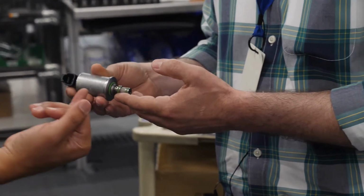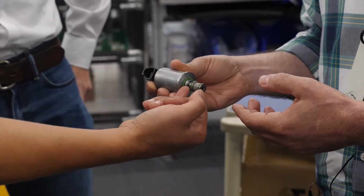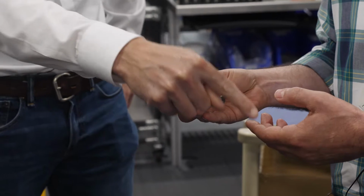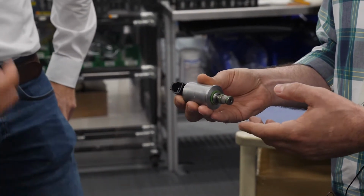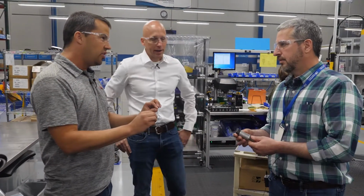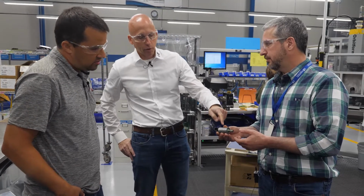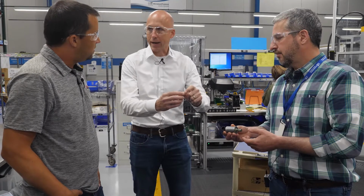So mechanically you have what, pressure coming in? Yep. At the screen, pressure coming out at the ports. That's actually tank. The pressure coming out to the spool would be out the bottom. And then the top point of this is what, a solenoid? Yep. Now to my brain, the solenoid is on and off. So is that not the case here? Right. In the case of this one, we can actually proportionally change the position of what you call the plunger, I guess, right?